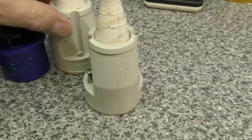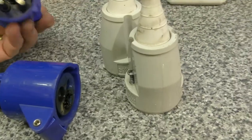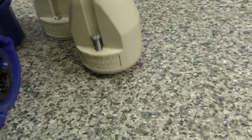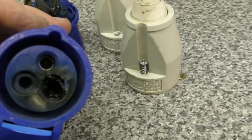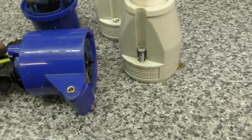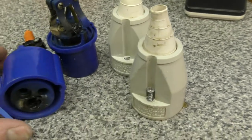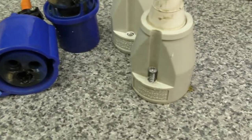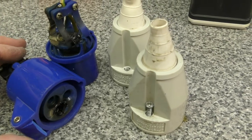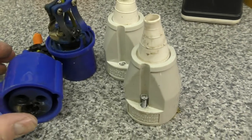When I touched the connector, even though everything had gone off, it was really, really hot. I actually burnt myself on one of the screws that holds the covers on — this was absolutely cooking. When I got in this morning the fan hadn't been on, so there was already an overload happening. Turning that fan on just overloaded it completely and tripped both the RCD and the fuse.